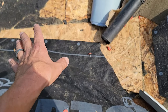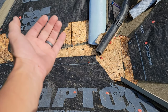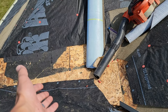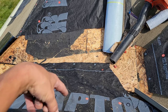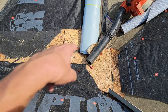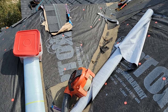The cost it would take to use a mineralized roll roofing with a lack of warranty, or the cost of EPDM or another low slope roof system — you can achieve this for a lot less with just some 2x4 lumber and decking. Probably about six 2x4s — one up each side of the deck surfaces, so on that facet and this facet for the valley nailer, then probably two through the middle, a small one here, a small one here, and then your decking coming down over it, then dry it in. Pretty simple solution.